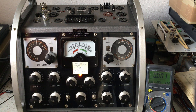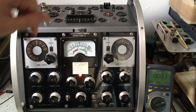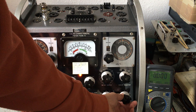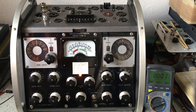Then I check for shorts on the electrodes: cathode, grid, screen — this tube doesn't have a screen — but it has two anodes. I expect no short on the cathode, none on the grid, and none on the two anodes. That is the expectation because I knew this tube was good, but you have to do this test always.